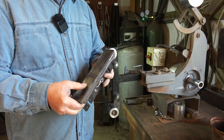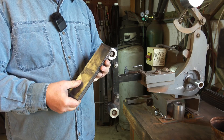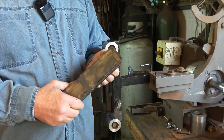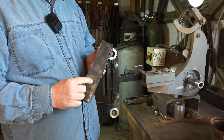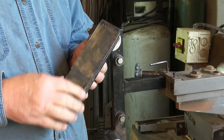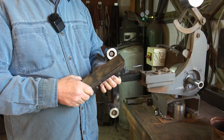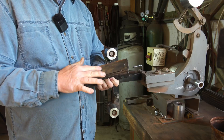Ceramic glass really does a good job of dissipating heat, and it does not wear — that's one of the benefits of a glass platen. It's very hard; it's not going to wear. You can't do any hogging of material with it because you will tear it up. Just like any platen, you'll get buildup from your belt that can cause divots in your blade. You'll have to clean them. But your platen needs to be very flat before you put your glass platen on there.